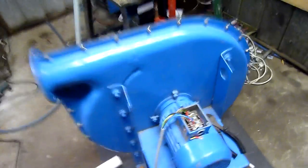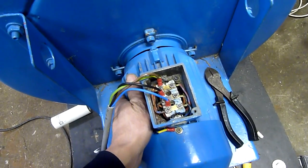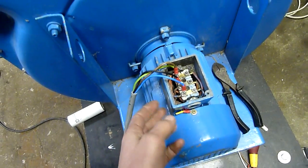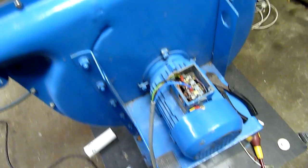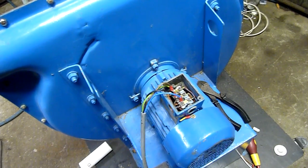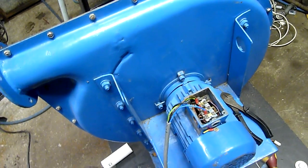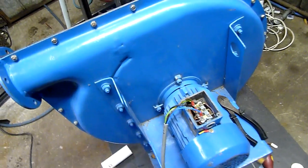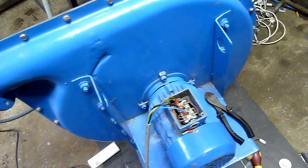It's a lot bigger motor and I've just shut this down. There's a little bit of warmth in the motor - I don't want to get it too hot. I already had a tiny wisp of smoke coming out the top. I know this motor was like a swamp thing when I found it, it was really rough, and the corrosion between laminations won't be helping its magnetic flux. But if I get some more use out of it I'll be really happy.